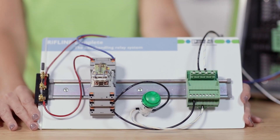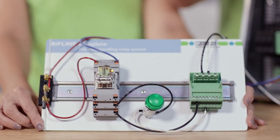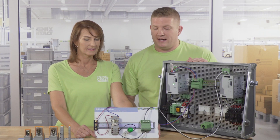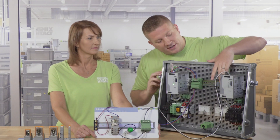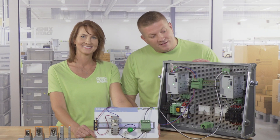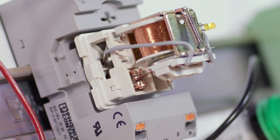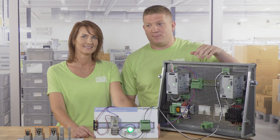There are actually two separate circuits that work in combination to make the relay operate. First, let's look at the coil side. When we energize the relay, it creates the electromagnetic field that will energize the coil. You can see here by this LED that it's energized. But since they are separated from two separate power supplies through the contact side, the light hasn't engaged. So let's turn the light on — and now we have a light. The electromagnet is turned on, which closes the contacts, which then turns on the light from the separate power supply.